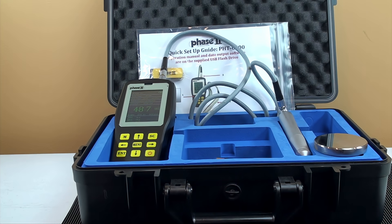This scenario is perfect for sensitive manufactured parts, engine parts for automotive and aircraft, bearings, and many other surfaces that need to be protected. Note the Phase II PHT6000 series is foremost a UCI portable hardness tester. However, it also has the ability to accept an optional dynamic Leeb probe and for large parts easily take tests using the Leeb system accurately and easily.